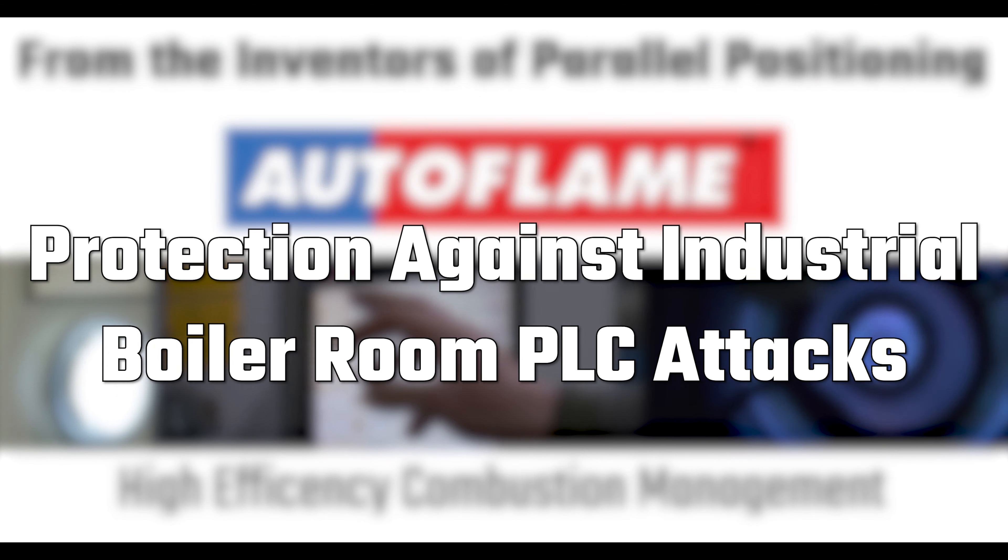The time clock lets us set run times for how the burner is going to operate. On Monday it's going to be on until 3:05 in the afternoon, then it will run at the reduced set point. If I want to change any of these I can click on here and by dragging these buttons around I can now say my burner is going to be off until 11 o'clock, then come on, then run at a reduced set point. I can drag as many of these as I wish, move them around. If I want to get rid of them, just drag them up and they go away. So this is how we switch between our two set points.